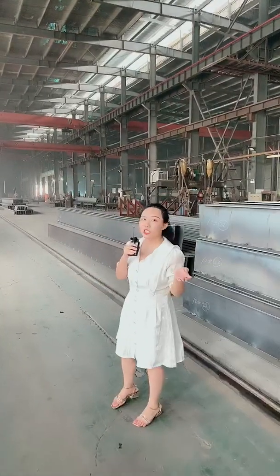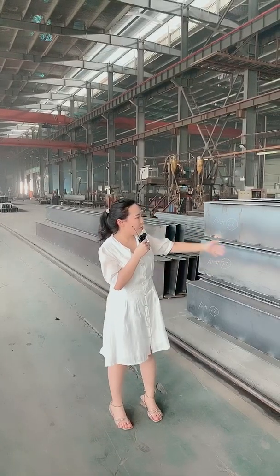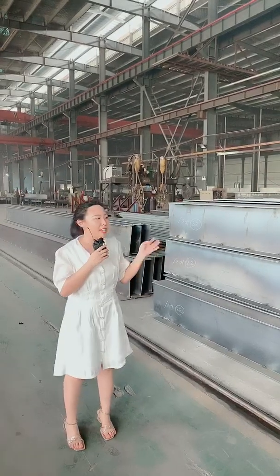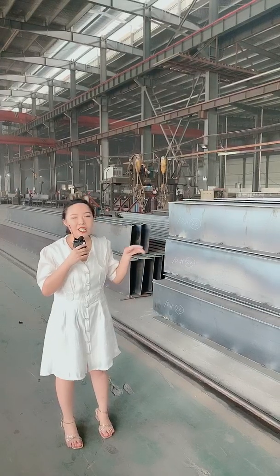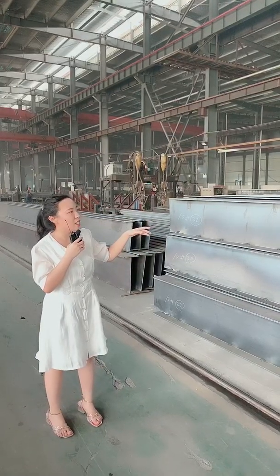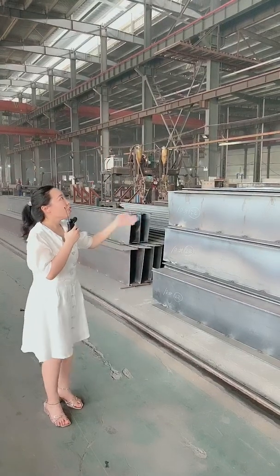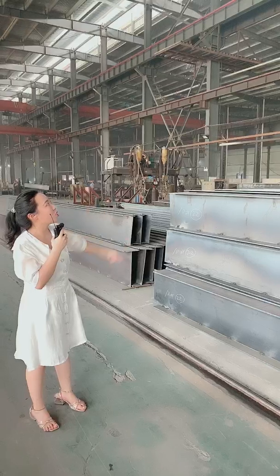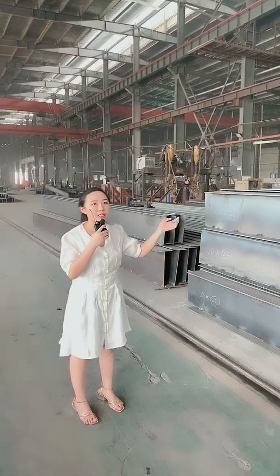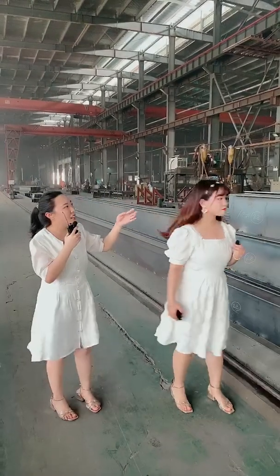After we have learned a lot about how the H column and the beam work, for now I can introduce you to the installation. For installation, we can start with the foundation, and I mentioned there are two types. After we connect the foundation with the column, we can connect the steel column and the beams using high strength bolts, and then we can do the purlins. For this workshop, there are the roof purlins and the wall purlins. It is a little far away.